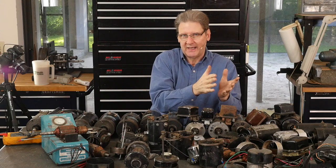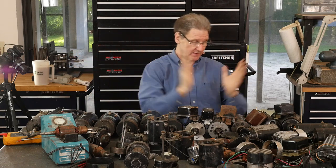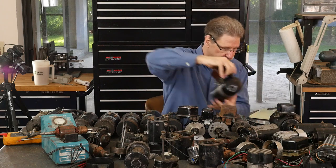They brought out the 65, first 6 months, screwed it up, and made a 65A. That's the 12-volt, 1965 all the way to 84. Then I think in 85, they put that weird alternator behind the clutch drum, and we're not going to talk about that because that's not a Sportster in my book. Before that, the K model had, it's just called a Model 52K. And I got one of those here off of my K model.